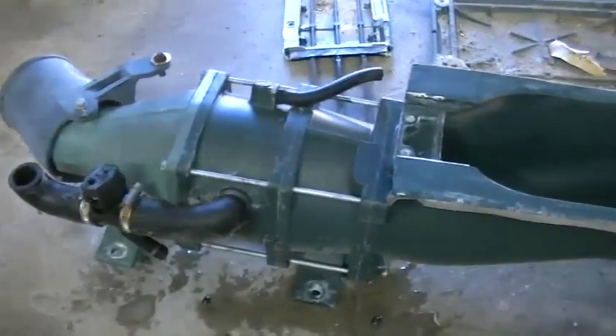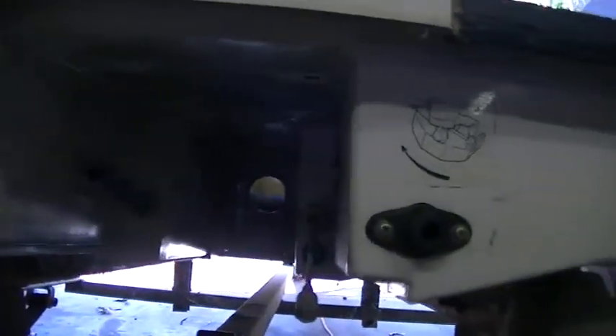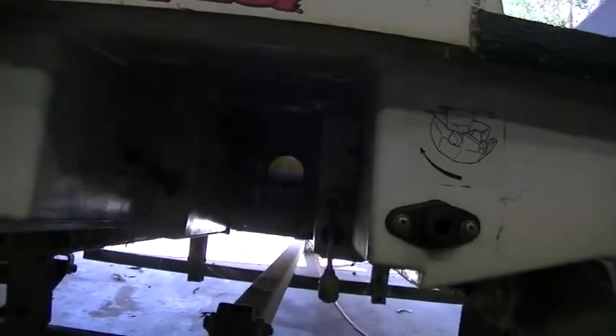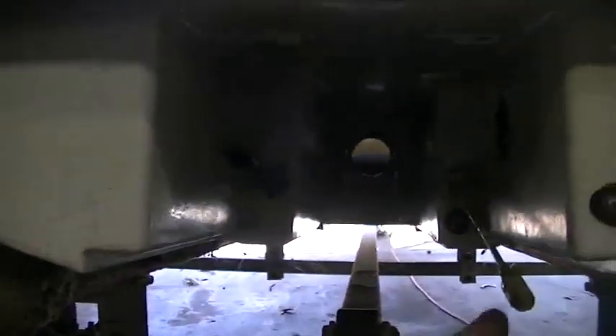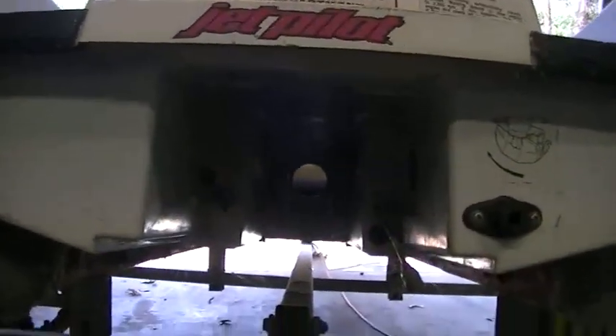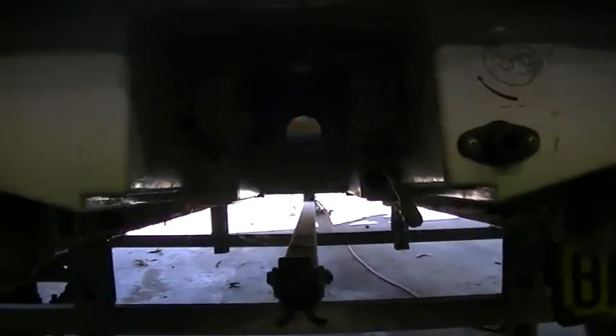Once I took the strainer and the belly plate off from under the jet and undone the four main bolts, our jet unit fell straight out, which I'm very happy about. The hole we need to make in the boat is looking very sophisticated with steps and bumps all over the place, so we're going to cheat. The jet ski's knackered, so what we're going to do is just cut this whole section out of the jet ski and glass it straight into the bottom of the boat, so our jet unit will bolt straight back in.